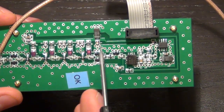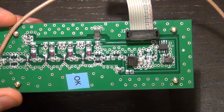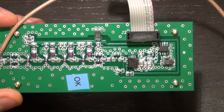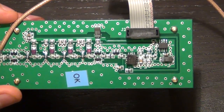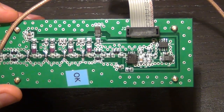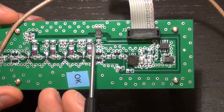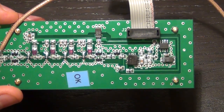And that's really important, because it ensures that this line here will have a very low impedance that does not change with frequency, and that is what you want from both your ground and your VDD. You don't want your VDD, for example, to look like a characteristic impedance of 50 or 60 ohms across frequency. That would be terrible. So what you would want is you want to decouple that to make sure that it stays a nice solid ground.